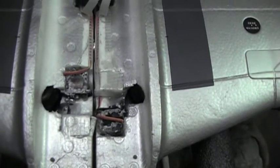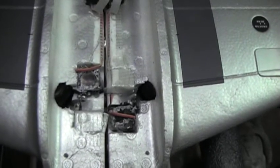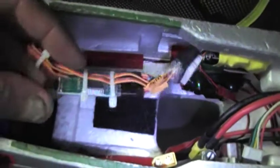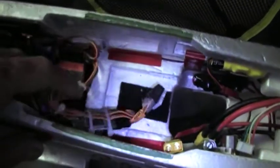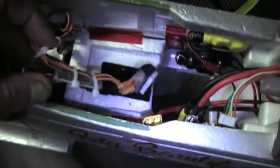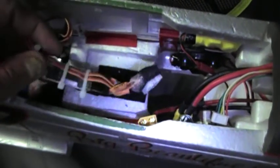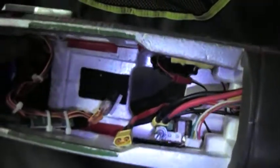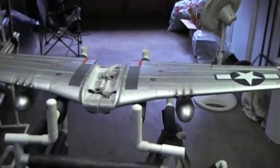There are plenty of other options around, but this was the smallest one I found that gives that sort of operation — a real small little unit. It's easily tied into the cable and super tiny. It gives you option one and option two: standard doors like a P-47 or other planes of that type, or doors closing in behind the gear once retracted up or down, P-51 style — instead of using the larger EMS sequencer, which is about the size of a receiver and can be hard to fit in smaller planes. Okay, there it is guys, thanks for watching.